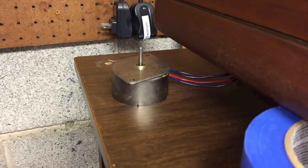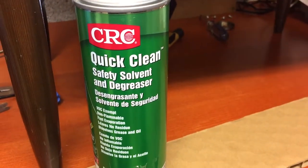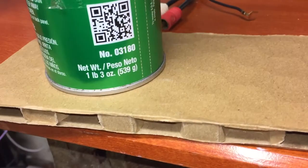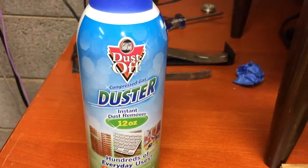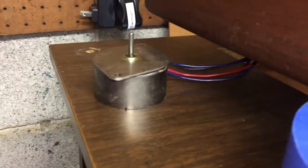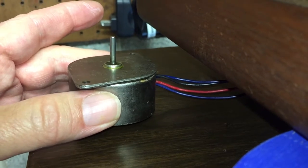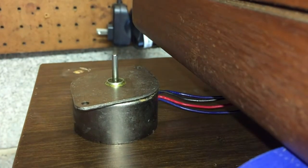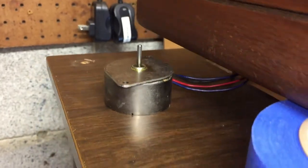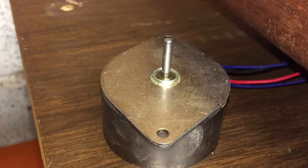Here's the motor running again. I took the back of the motor off and sprayed the insides with CRC Quick Clean — tetrachloroethylene, part number 03180 — and then blew it out with compressed air in a can. It's noticeably quieter. It's still very buzzy when I hold it in my hands, but it's an improvement.